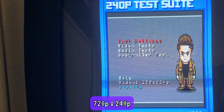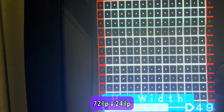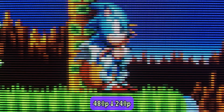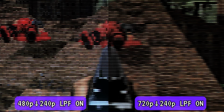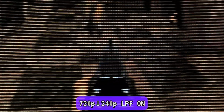The SNES Mini outputs skinny 720p HDMI, however the XRGB-3 is also inadequate to fully stretch to each side of the CRT. And Artemio's trenchcoat guy looks like he's in need of a meal. Which leads me to the XRGB-3's biggest letdown, 720p input. Yeah, it can downscale from 720, but it's significantly blurrier than a 480p input.